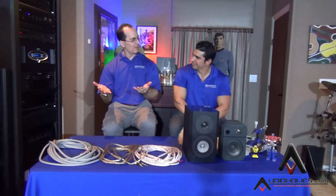So the claims you asked for on bi-wiring, this was on the forums a lot years ago, and it's kind of died down. I wonder if it's because of all the education we've been doing. Anyways, they would claim it reduces back EMF, it reduces distortion seen by the amplifier because now you've got the highs going through one cable and the lows going through the other cable. It's all BS, Hugo, because what happens when you tie everything back together on one side? What does that signal do when you tie it together? Yeah, it's summed there at the amp. Exactly. The amplifier has a low output impedance.